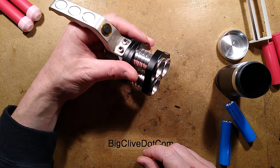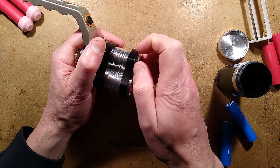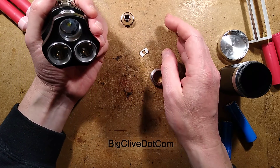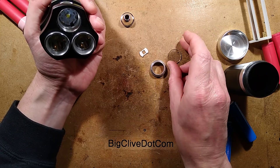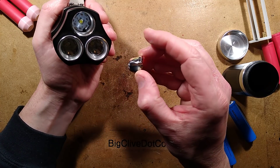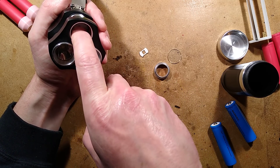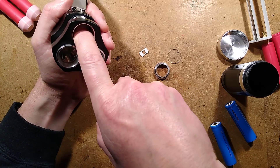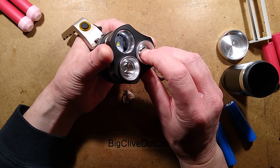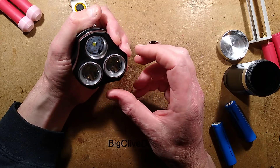But it's not as good as that. The front unscrews, each of these rings unscrews, and when they do, the circuit board inside, the reflector — there's a little plastic spacer, I think between the reflector and the LED. You've got a glass lens, which is nice. You've got the locking ring, and then the reflector — as you tighten that in, it pushes the LED down tightly onto the aluminium housing. It's actually spring-loaded. Theoretically I thought it was going to push it down onto the aluminium housing and make a good thermal connection, but in reality when this is screwed together, you can press these down — it's not making a good thermal connection. The reflector appears to be metalized plastic, so that's not going to act as a thermal conductor to take heat away from the LEDs.